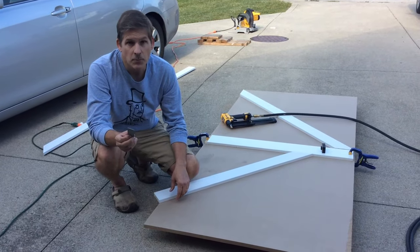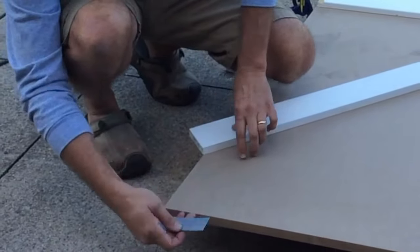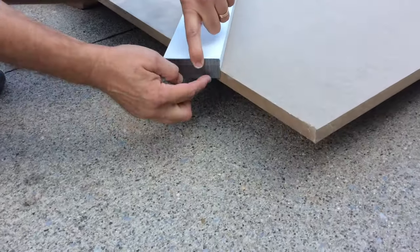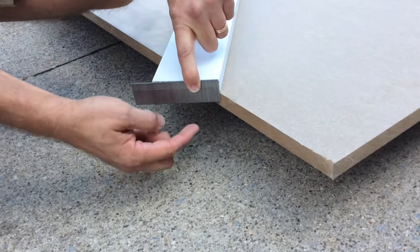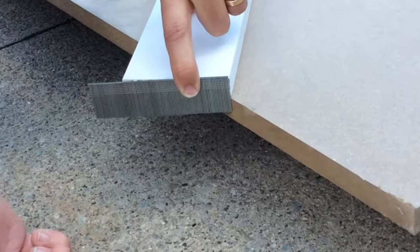When you're choosing a nail for a project, you want the nail to go through all the material but not come out the other side. It's a matter of putting your nails up against the board or measuring. These are one-and-a-quarter inch nails and this board is about one-and-a-half inches total. So if this nail goes into the meat of this board halfway, then we're good to go.